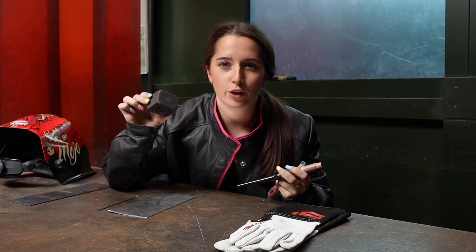When welding aluminium, I use a zirconiated tungsten, which are the white tip tungstens. These require a balled end. A blunt tip tungsten is basically a sharp tungsten with a flat edge on the top. This can give you better penetration, but it can give you a wobbly arc. Don't worry if you don't have a carbon cube to ball your tip on — you can also use a scrap bit of aluminium just by heating the tungsten very, very hot.